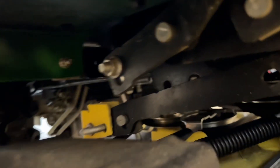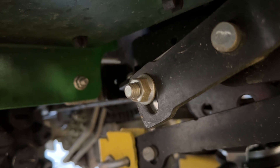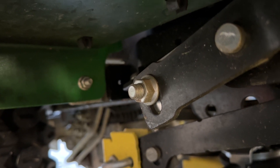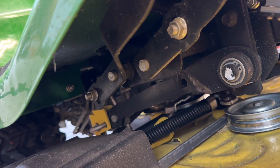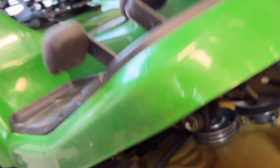Same thing on reverse. If you look there, I've actually got mine slid up and maxed out because I like my pedal a little higher — that's not where it was from the factory, it was actually in the middle. So that right there is often the culprit why your tractor is moving too slow. Before you go tearing into things and changing belts or taking it to the dealer, check those two bolts. It could just be a simple adjustment of your pedal travel.